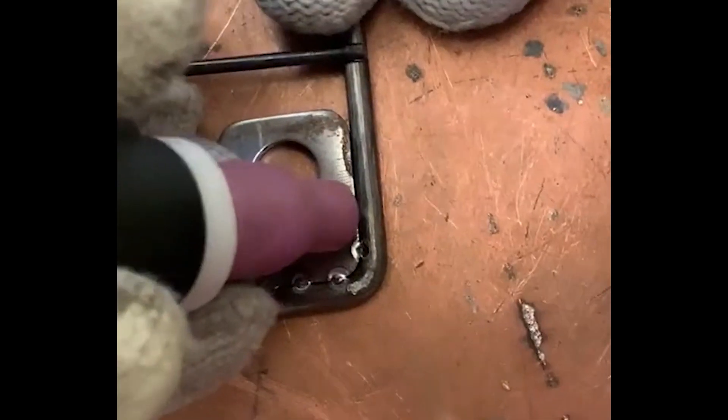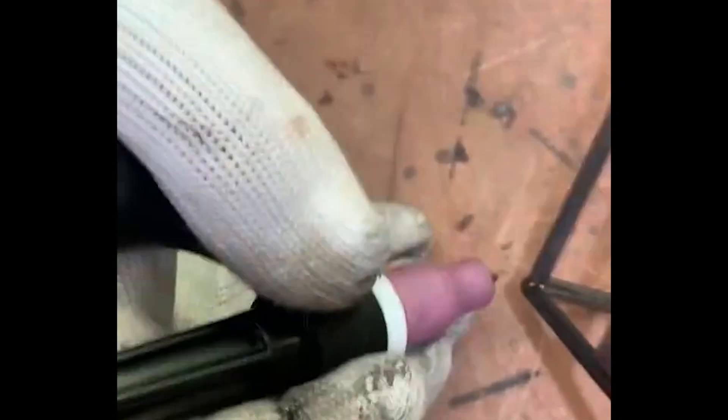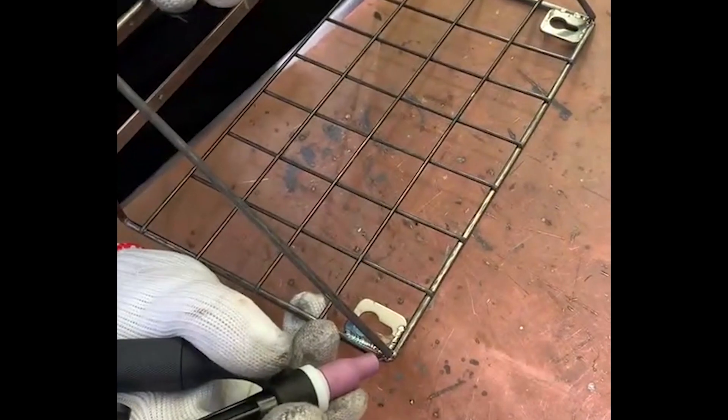The main reason for blackening is surface oxidation of the weld and high-temperature oxidation of surrounding materials. Key causes include unclean plates before welding, insufficient argon protection, long-term welding with excessive current, improper distance between the tungsten needle and weldment, improper selection of tungsten needles, failure to continue protection after welding completion, and inadequate protection of the back of the stainless steel weldment — these are the culprits causing discoloration.